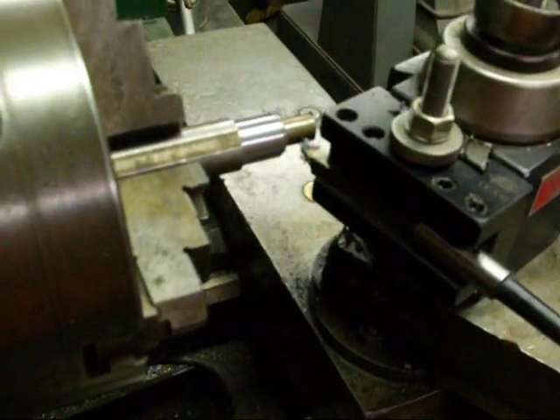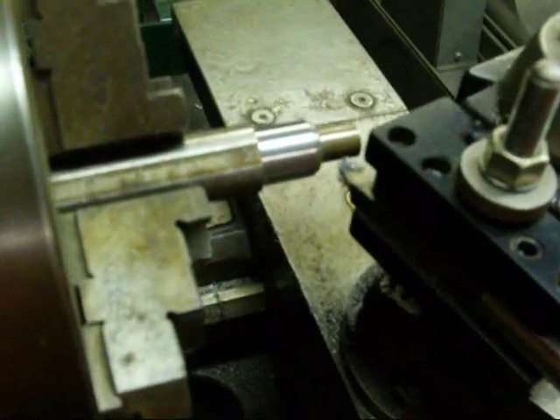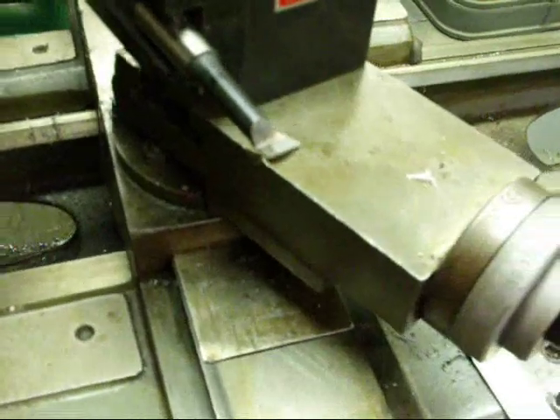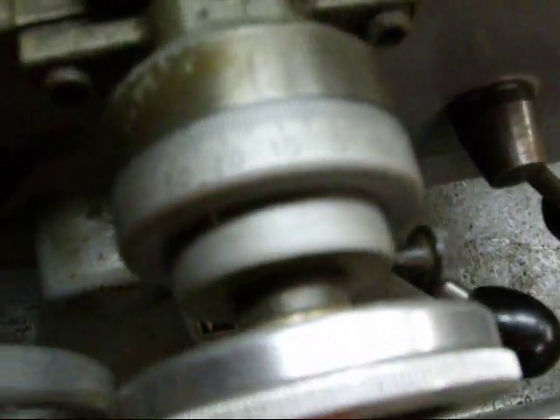You can't really avoid it. So in taking the final pass here on the lathe I have ten thousandths more to go, and I'm going to do that in one pass. I've set my cross feed to zero and I'm going to feed in exactly ten thousandths. Whoops — I went over, I went twelve thousandths. Now this is exactly what I want to talk to you about. It will do absolutely no good at all to back that off just two thousandths — you need to back it way up about a half a turn.